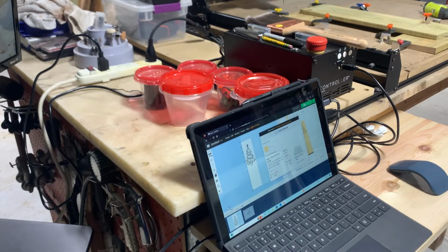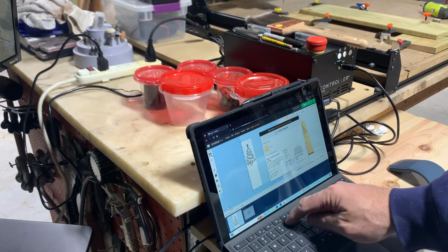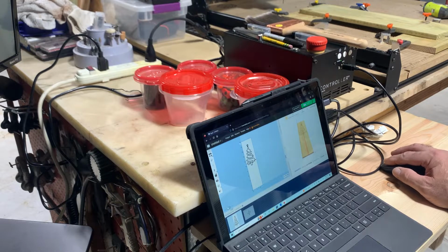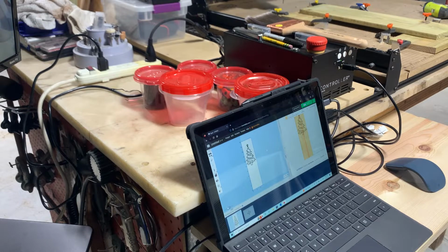This is the part I've kind of noticed on this. So we're going to go 0.590. That's the thickness. Now whenever you highlight this, it's going to show over here that your thickness is 0.590. If you want to cut all the way through, then you set it. If you don't want to cut all the way through, then you can put a scale, but then it shows that it doesn't cut through. So we want 0.590. That's the thickness we want. But anyways, the way I got this set up, let me bring it back up.